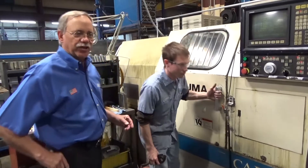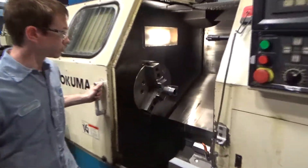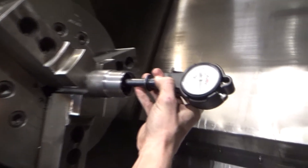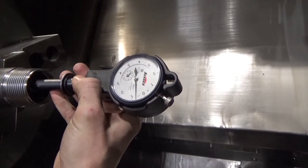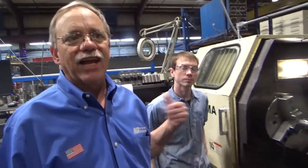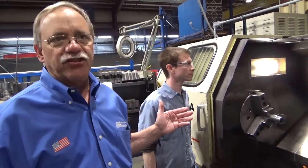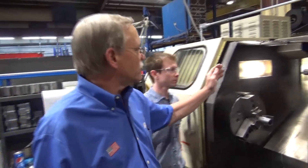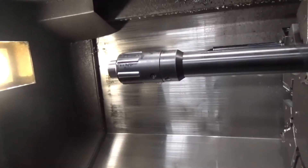Steven just finished the cycle here on this. We're using our dial bore gauge — you can see that the bore gauge reads within one ten-thousandths of an inch, much like a lot of guys would have an engine bored out. We're boring this tubing out, and then to finish that bore to make it a good finish for the shock absorber, we use a roller burnishing tool.